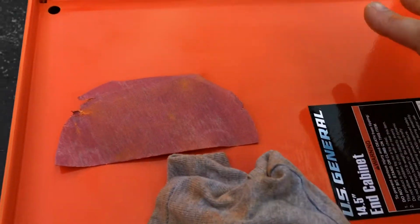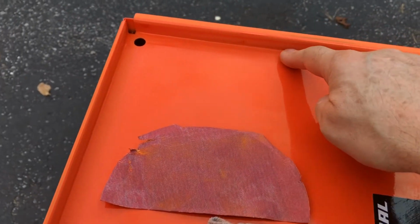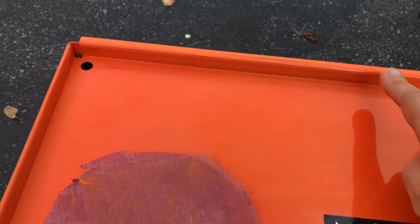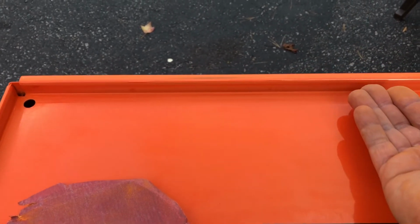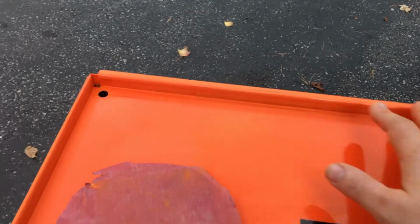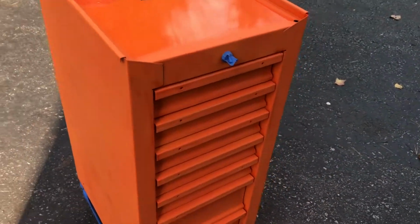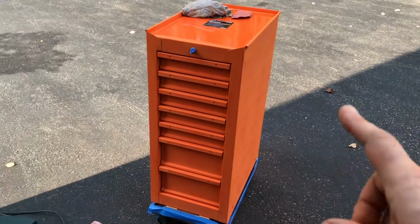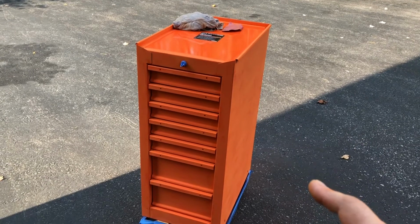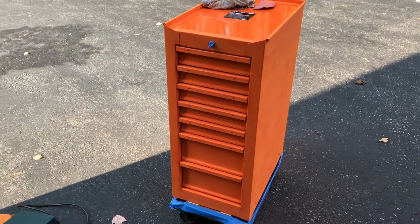And we've also sanded here. Again, I've told you I'm not going to paint the top because there's a nice ribbed pad that covers this, but we've sanded all the way to this flat here because I want the paint to adhere to that crack. We don't want the paint to start to lift here and it'll lift up through there. So every surface that you want to have paint stuck to has to be sanded. So what I'm going to do is we're going to wet clean this. I use rubbing alcohol and a clean rag, and then we're ready for paint.